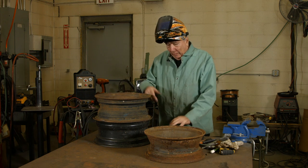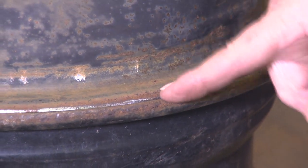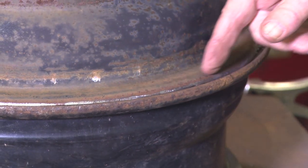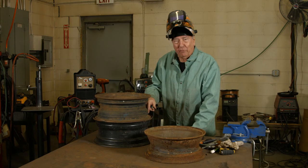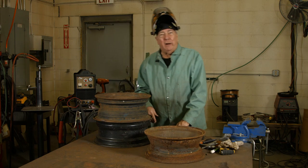I'm also down in this groove and it's going to be a little tricky, because I've got to weld down but I also can't let the wire touch the edge of the rim or it will short out. So it's a little bit tricky, but it can be pretty easily done — just be careful.